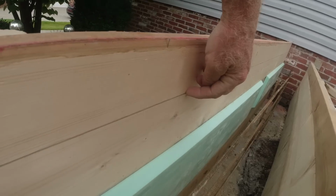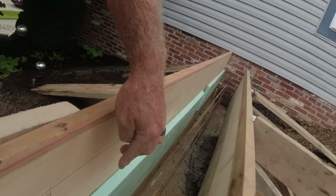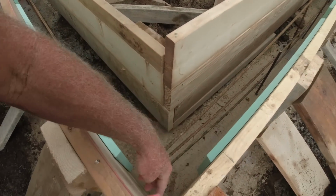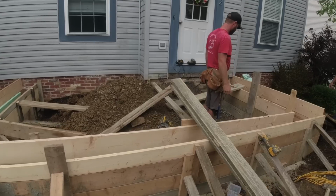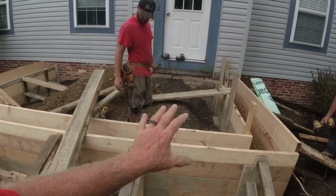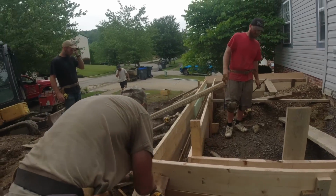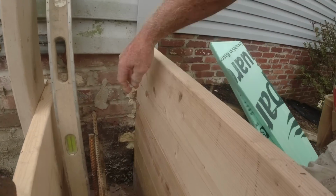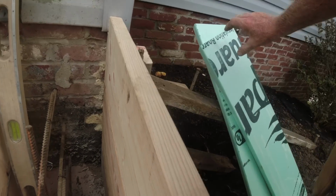So pencil line is top of concrete, 5 inches down is the top of my inlays. 5 inches down the whole way around, 8 inches on my corners, 8 inches in between. We're adding the last 2 over here. Remember, this is all step, no inlays here, you won't see it. Jim's finishing up kickers. So 8 inches over, 5 inches down.